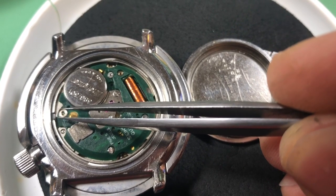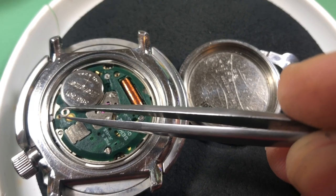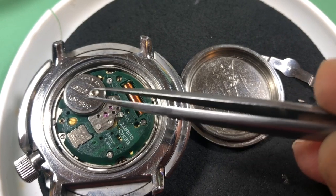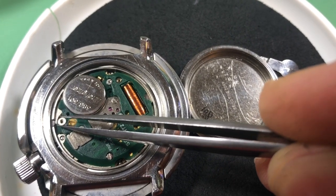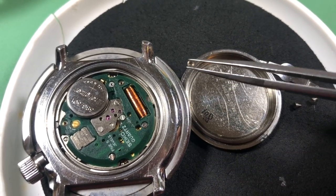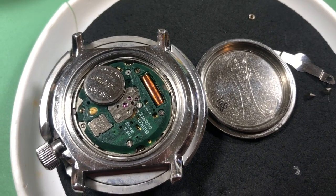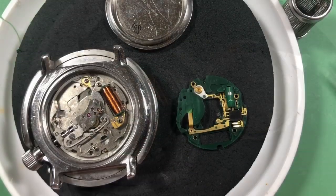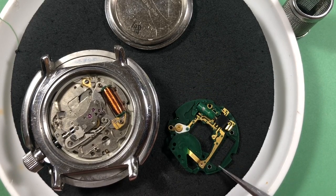It's a pretty critical element because the battery strap only happens in 7548s and 7549s, but this movement was used on a whole range of them, and the dress watch ones don't have the battery strap and don't need this support piece there, but without that you can sort of crunch stuff. So these are very hard to find, so it's good that you have yours. That's good. No water got in and the watch was taken care of. Okay, let's move on. Always something good to see. It's nice to be able to show things that are right instead of damaged.